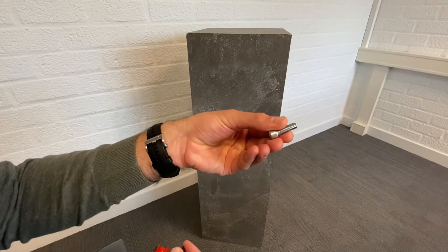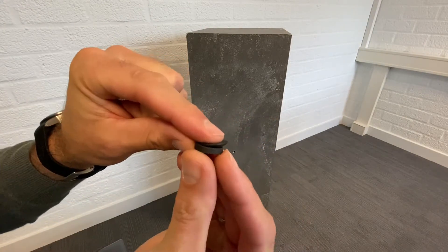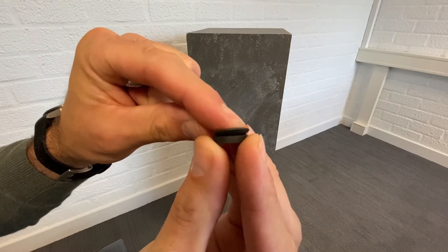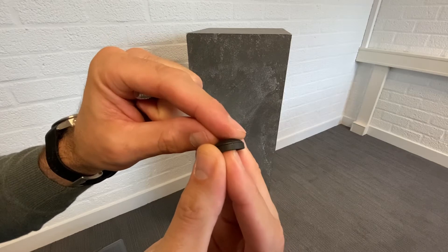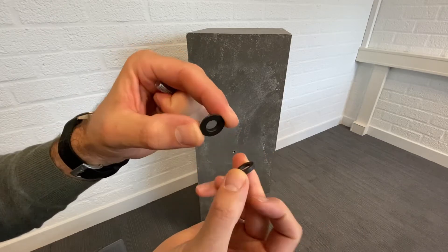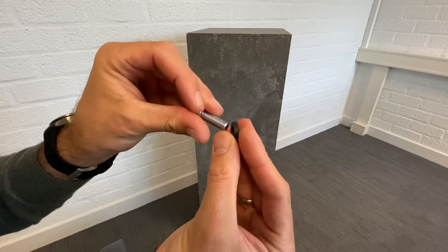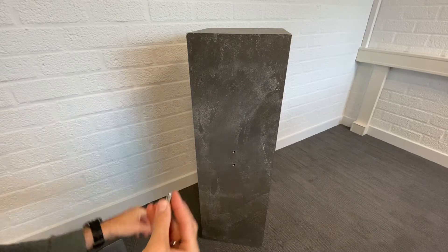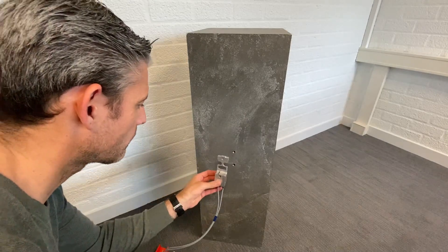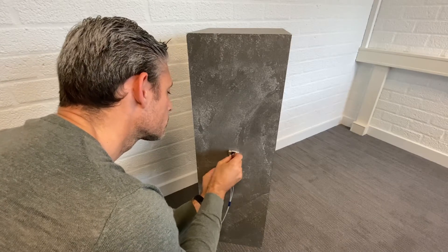The short bolt is being used for the upper part of the sensor, and always use one pair of washers between the bolt and the sensor — never use them individually. Always use them as a pair, because if the holes are not drilled 100% perpendicular in the concrete, this gives you the flexibility to still mount your sensor properly.